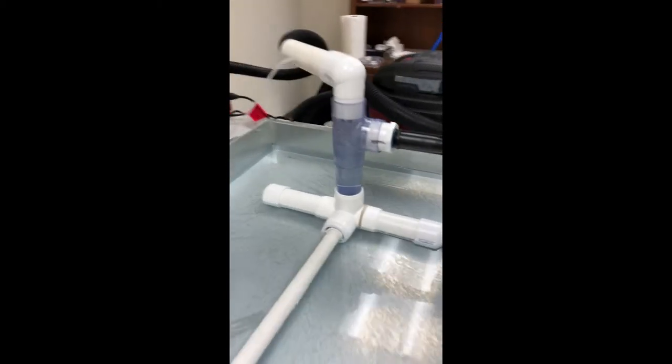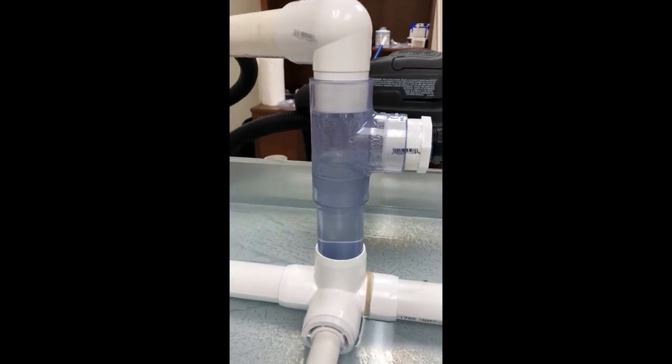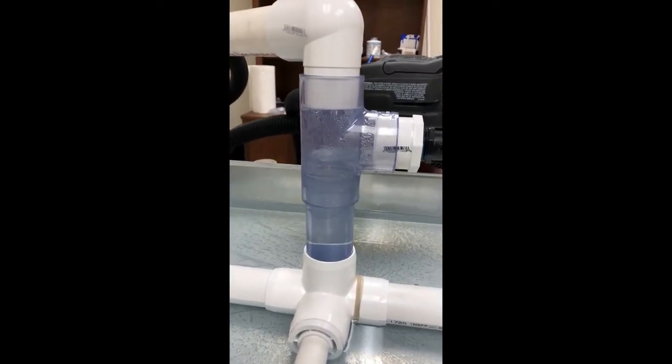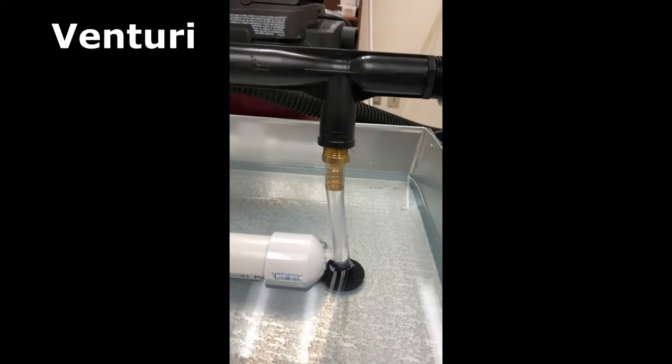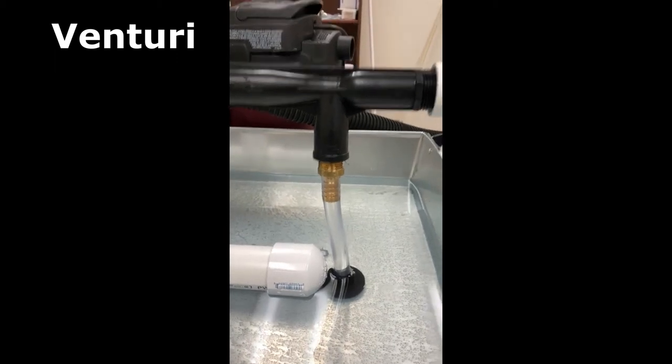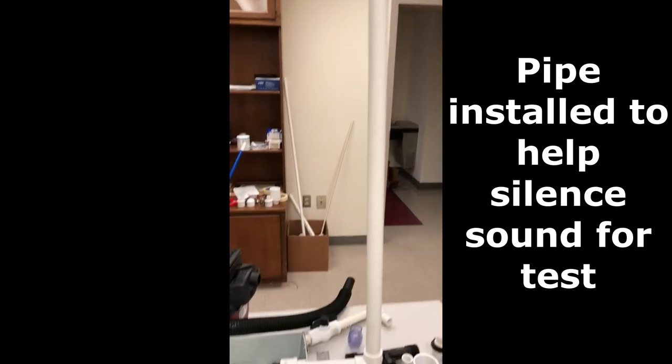What this does is it actually lifts the water using a Venturi injector, pulling it up from the drain pan into the injector and over into the reservoir. We use the pressure differential between the positive plenum leaving the unit and the negative pressure in the unit plenum.